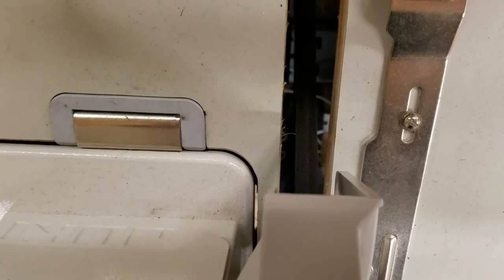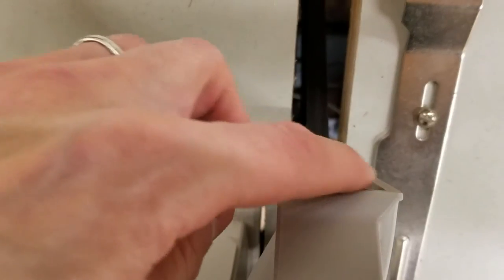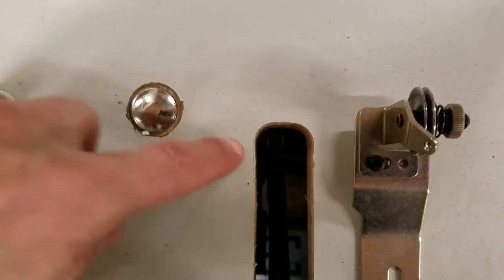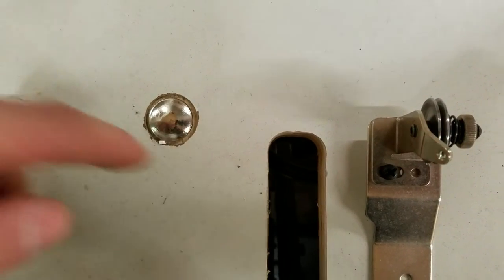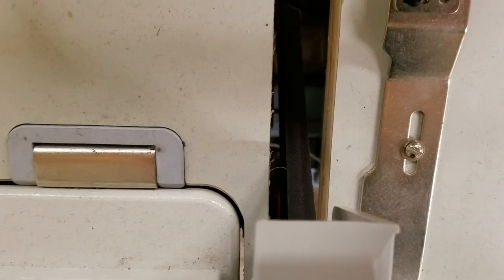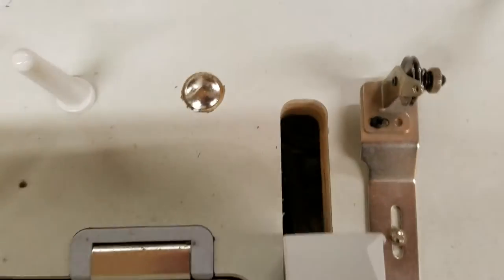You could see where the belt is lined up. If the belt's off to one side, check your motor. You can see our motor's a little bit close to the inside here, but it's still not going to stop it from running. If I come around the other side just so you could see what it looks like from there, you could also see the belt's not touching anything.